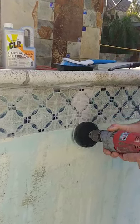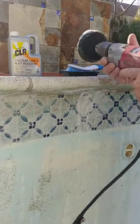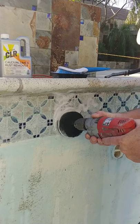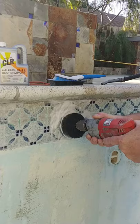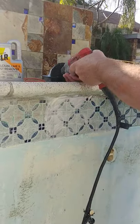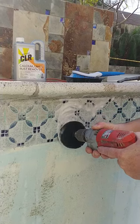I'm going to do a low speed and very little pressure to let the bit do all the work. I'm just doing one row of tile at a time, and then I do the next one. Just doing one tile at a time, making sure that it's really, really wet — that's the most important thing. The more wet it is, the faster it is.